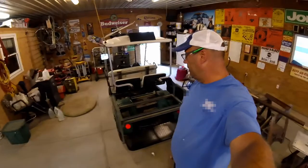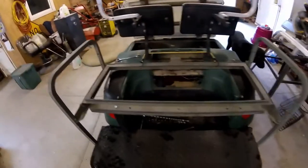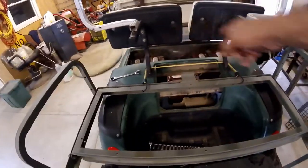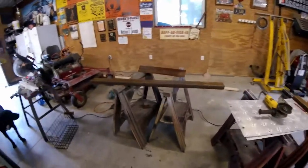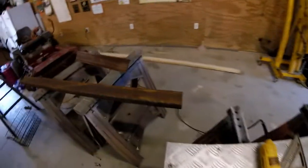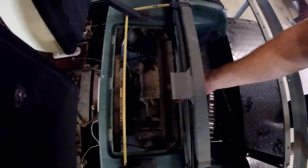Last week I showed you a little preview of this golf cart. So far I cut these brackets off of the existing seat — it's just sitting there roughly, not centered, held on by a yellow strap, just trying to figure out what I need. Went out back and picked up some scrap stuff: a piece of channel and a piece of angle. Cut a piece of channel 15 inches — I have 16 inches inside here — so I'm going to center this out.